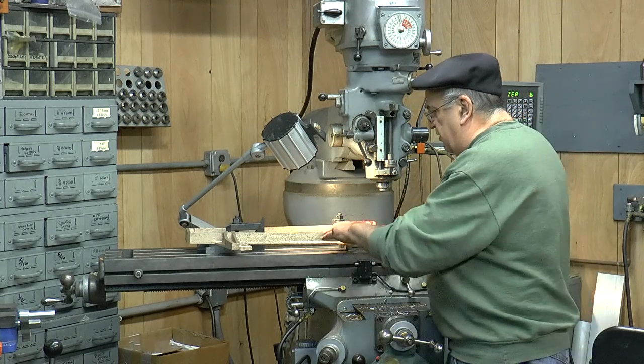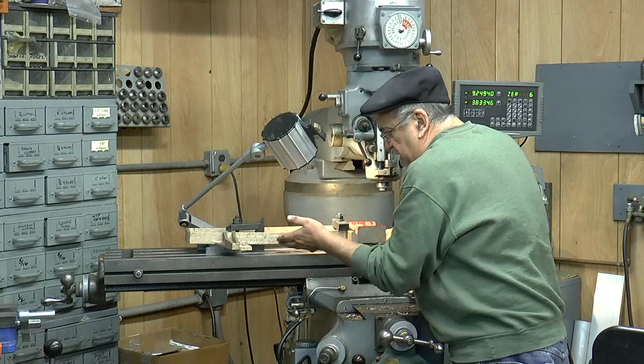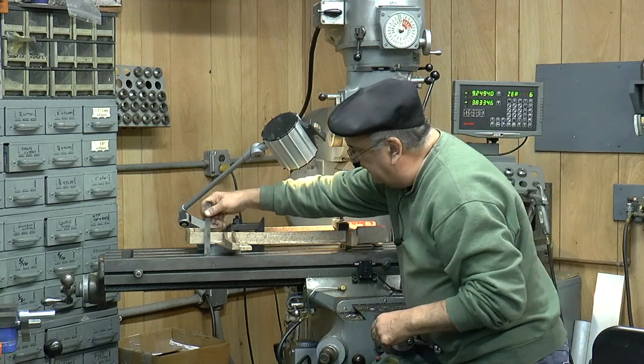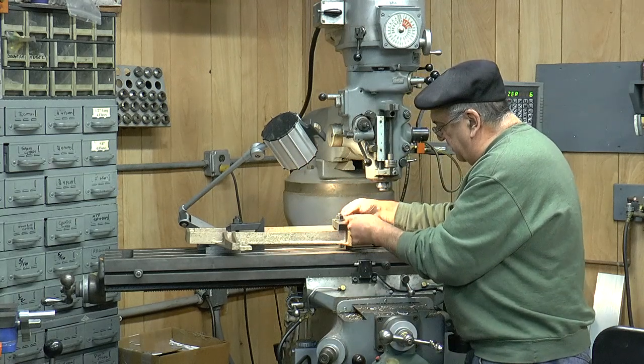This cradle is flat on the top here. Right here is flat — that's your plane — and this goes up this way on the bottom. So I measured down from here down to the table, here down to the table. And the difference is about 3/8 of an inch difference on this end and on this end. I have a parallel right under this area.